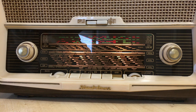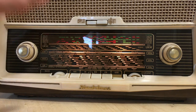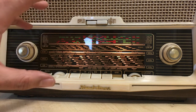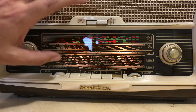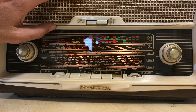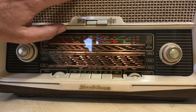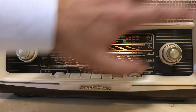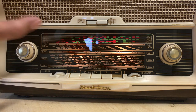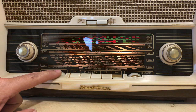The quality of the sound is surprising for what one would expect from this size of cabinet and this size of speaker. This is a single speaker, there's no tweeter, there's no electrostatic tweeter or otherwise. You've got a full range speaker. So they obviously use probably a mid to high mid-range, you know what I mean? Mid-range, but sort of to the higher end of the mid-range, sacrificing probably some of the bass on the speaker itself. And then they use the resonance of the cabinet to give you the boomy part of the bass. And so you have to control that here because you can get too much boom, as I've experienced.